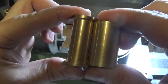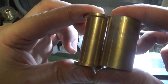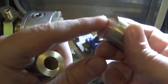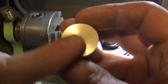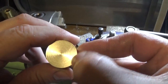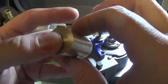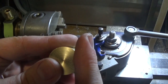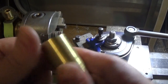We've faced both ends and got that to 1,630 thou, which is a really nice fit in there. It's a bit of a hairline through there — we might have to file a little bit out of the corners to make it fit nice, but it's not too bad. Next job, we need to make it an oblong, which needs to be 540 thou by 800 thou. So the first thing will be to machine one side off until it's just on 800 thou. We're going to do that in the four-jaw. It doesn't matter much where it's set up even, but that's probably the easiest way to get the first face right.